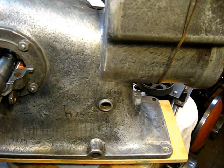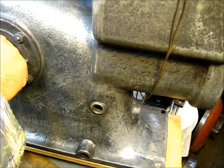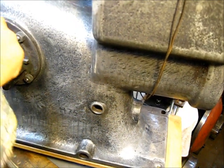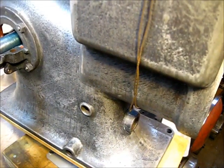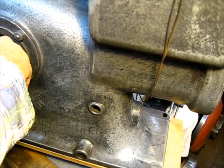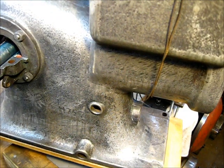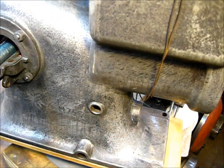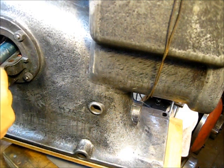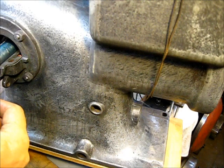Now, let's put a little grease up in here on the side of that crankcase, and a little more right in here, because we don't want any friction to interfere with our adjustments. In the same way here, I have pre-fitted that, and I kind of have an idea on the shims. And the thick one goes first. Put your thick shim on there, and then your adjustment shims. Okay, I got 4 shims. That's a 15, a 19, a 11, and a 17.